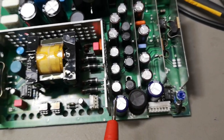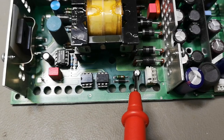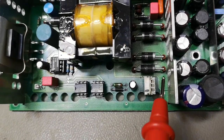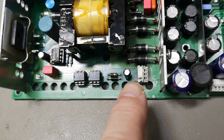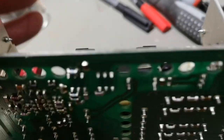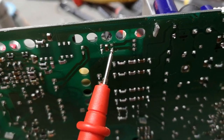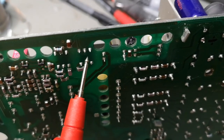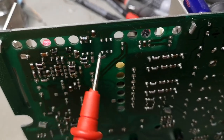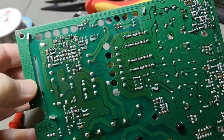This capacitor is actually the filament capacitor for the CRT, and as you can see there's quite a lot of extra isolation around that. You can imagine the filament is connected more or less to the cathode, so that is minus 2000 volts. This is why you have all this extra distance, and with a leaking capacitor here you could potentially get some leakage into something here. And here is the feedback system for the regulation of the main switch mode regulator — so that could possibly be why it's so unstable as well.